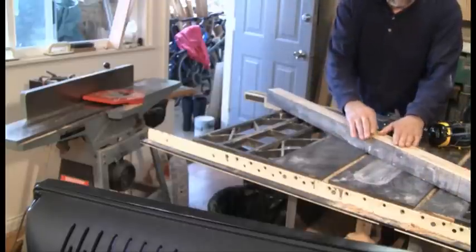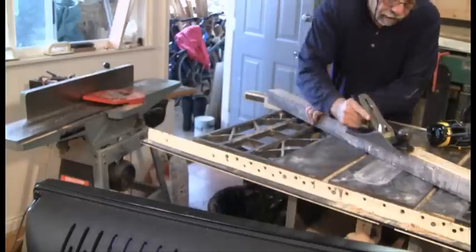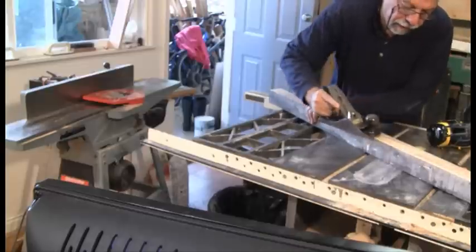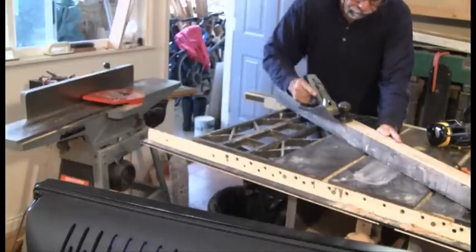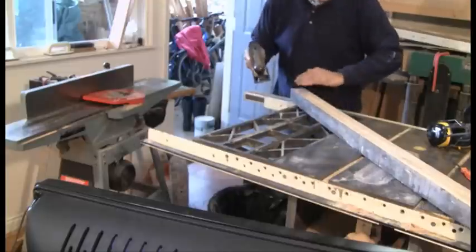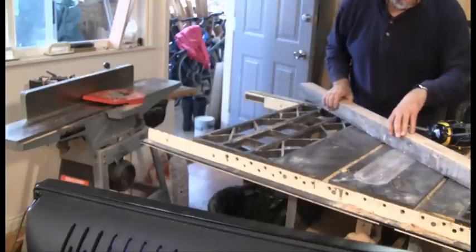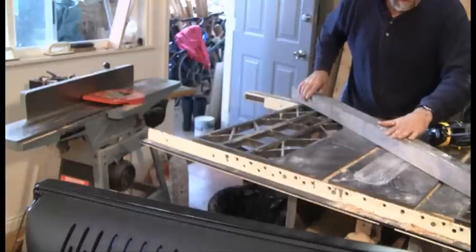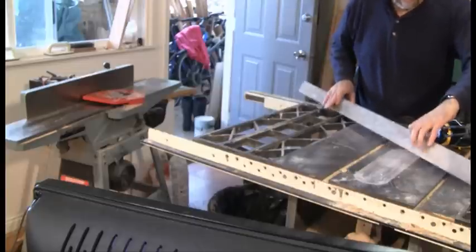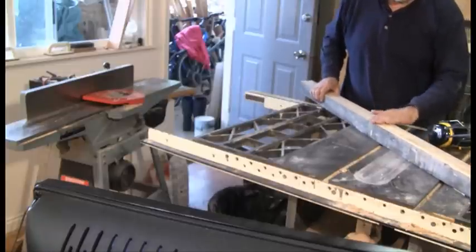My circular saw didn't go quite deep enough in some spots here, so there's a little bit of variation. I'm just going to use a plane and clean up a couple of these little ridges along here so that this is going to be absolutely flat when we get it onto the jointer. Now I want you to see this — this is the same flat surface, and look at what we have now: there's no rocking. There's a little bit of rocking this way, but there's no dipping, and that's what we need to eliminate. So let's go over to the jointer and start dressing this side.